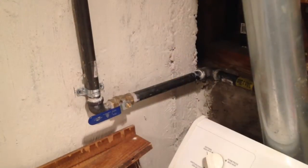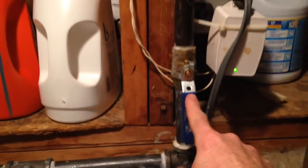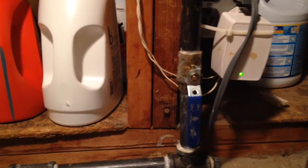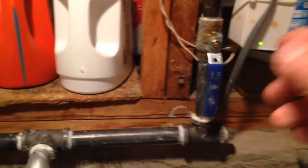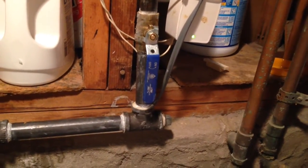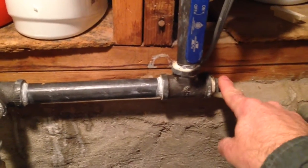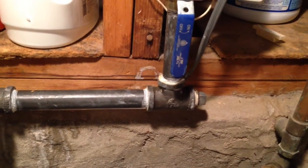Now we're going to go to the electrical panel and switch over to generator power. This is inside my basement — here's how I ran my gas and electric line out there. This is a three-quarter inch gas line coming off this three-quarter line. I put a full port valve here — I didn't want a small regular valve because I don't want to restrict the gas flow. I put a gas valve here because every time I do work here I have to shut off the gas meter outside, which also shuts off the pilot light on my hot water heater. To avoid that in the future, I put this intermediate valve. I also put a T here with a plug in case I wanted to expand — like adding a fireplace or another stove.